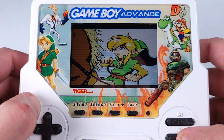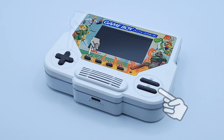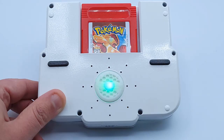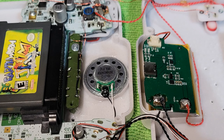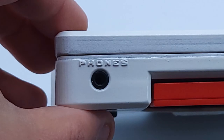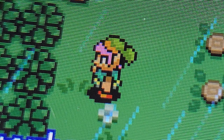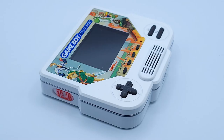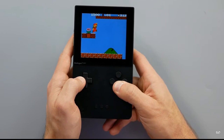Let's bring it around the system and let you see what's what. On the front we've got the standard interface: B, A, and D-pad buttons for controls, plus Start, Select, Backlight Plus, and Backlight Minus buttons which also double as an extra set of L and R buttons. On the back we've got the cart slot, the R and L buttons, an LED backlit decal, and six recessed screw mounts that hold the case together. The original GBA only had mono out, and this uses an upgraded 28mm Mylar speaker for main audio, along with a relocated headphone jack and volume wheel. These features really rounded out the style of the Tiger handhelds, and the upgraded funnyplaying IPS screen and 1500mA USB-C rechargeable battery pack gave a huge upgrade to the Game Boy Advance itself. Combined, it came out as a concept I was really happy with — and while it's no Analogue Pocket by any means, a grudge still held from my childhood has now been settled.